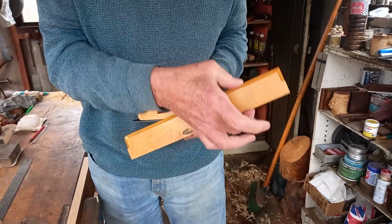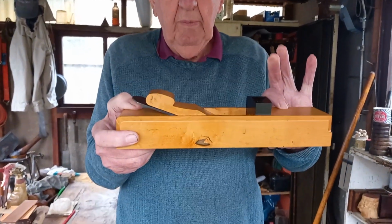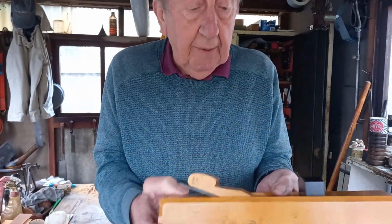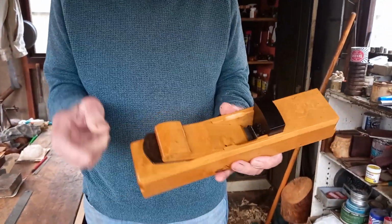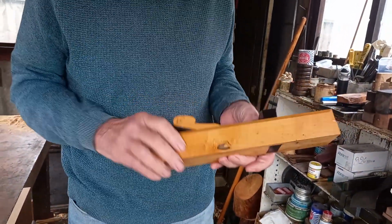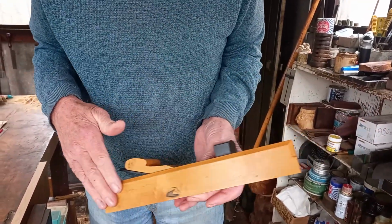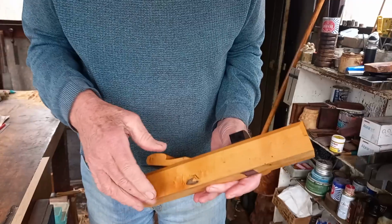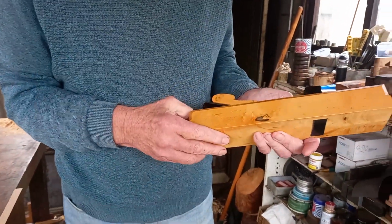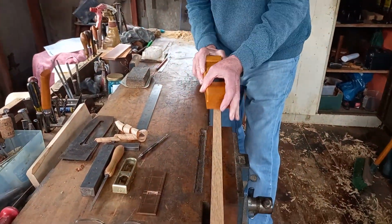This one is obviously thin in that regard, because that would have been the biggest piece of boxwood I had at the time for this particular plane. A plane of this dimension, and there's no set rule for dimensions on an English wooden mitre plane, but one of something like that, I think it measured about 11 3/4 inch long, would normally be a good ½ inch deeper than this. But like I say, I haven't got the depth on this one.